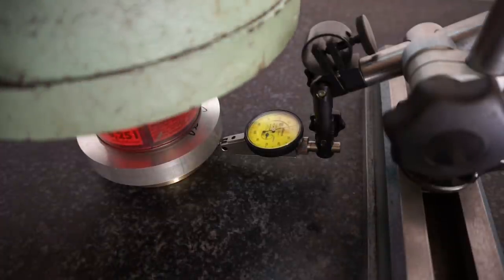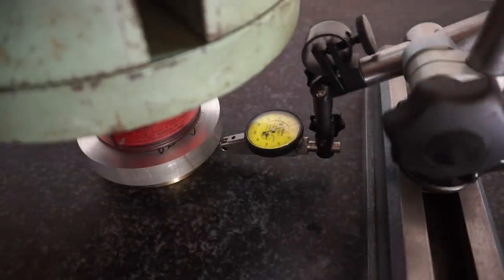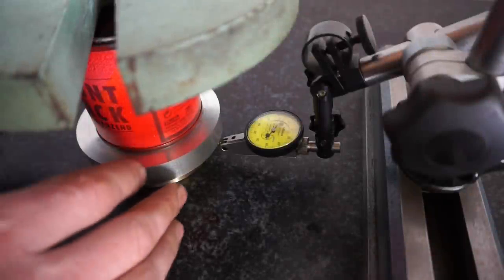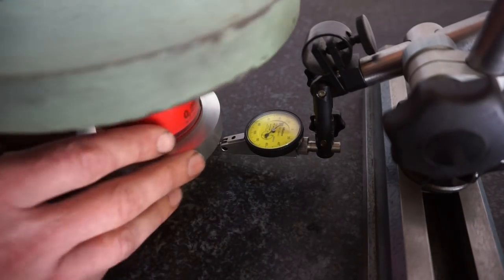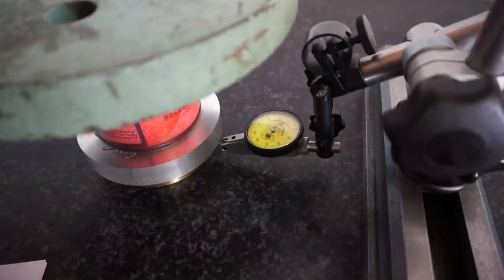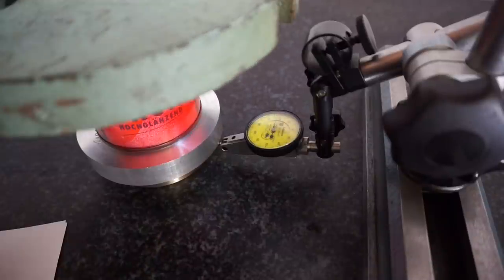So I would say we're at minus 7, minus 11 microns, so this gives minus 18, and this leaves us with roughly 6 kilograms on our bearing, and I'm sure you will notice that our runout has increased significantly, which is an indicator that we don't have full contact established inside of the bearing. But still, we will note the value, or the mean reading, which is minus 29 microns.